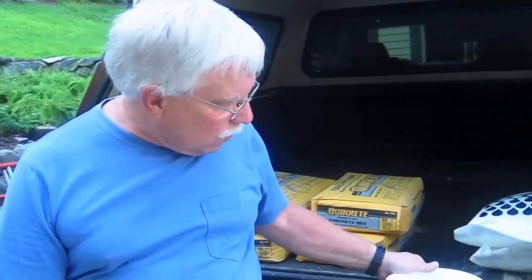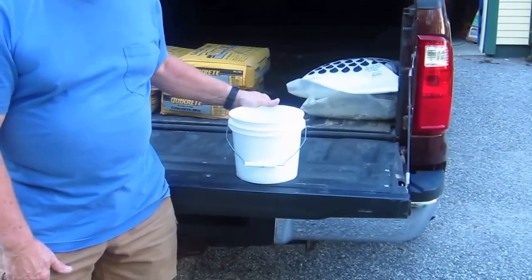Here's what's really important. We don't want to get the concrete too wet on this first layer, because we don't want it to be too soupy. We want those drains to sit on that nice, firm concrete. So it's really important that you add just enough water. The instructions on the bag say to mix approximately three-quarters of a gallon with one bag of concrete. Here's a little one-gallon bucket with about three-quarters of a gallon of water in it. But here's the trick — I'm not going to pour all the water into the wheelbarrow. That would be a mistake. You can always add more water, and you can't take it out.